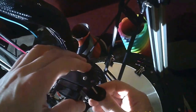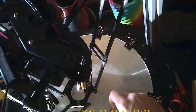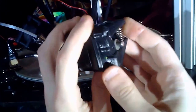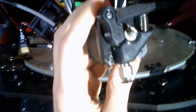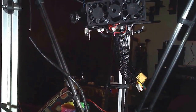As for my extruders, they're awesome. I showed you the NinjaFlex print and these other prints — they're holding up great. At first I had the EZ Extruder from SeeMeCNC, but it was too bulky and I wasn't keen on their design. So I did my own extruder design. It puts the pneumatic connector right into the assembly itself — it screws right in, everything lines up perfectly, and you're not going to get snagged as you drive filament through. Tensioning is good. The gear isn't hobbed in, so there's no place for the filament to go underneath — it's only going to go through. NinjaFlex works perfectly. It's lightweight, low profile, and easy to print. I did this in polycarbonate too. I have two fans cooling down the exterior motors because I'm running the current on the potentiometers pretty high, so they do get hot.